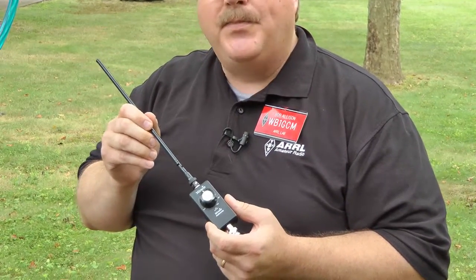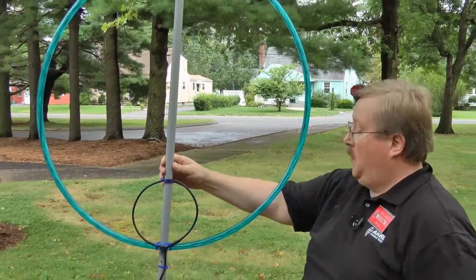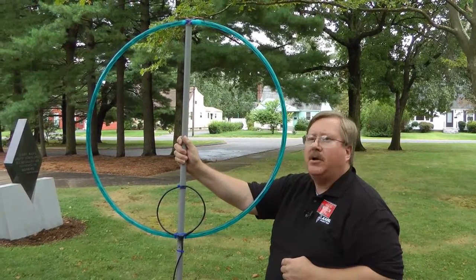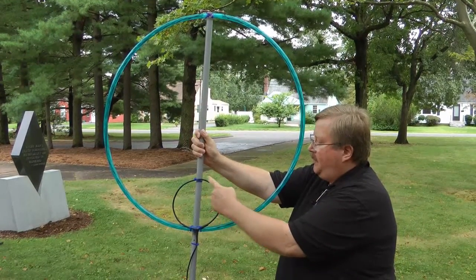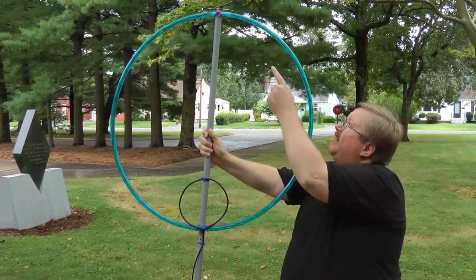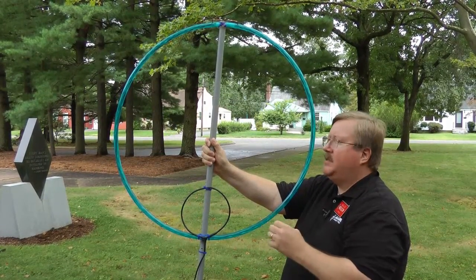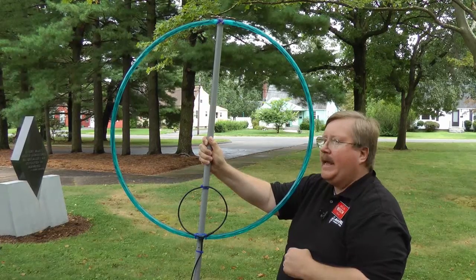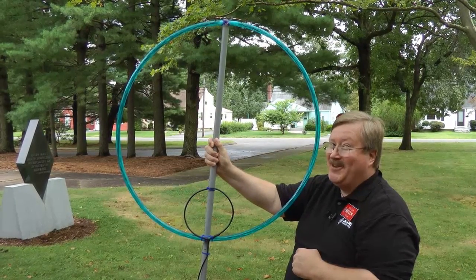So I decided to build an antenna. And here it is, introducing the Hula Loop. It's a Hula Loop with wire inside - it's a magnetic loop, you've probably seen these in past articles of QST. This is a simplified design that only consists of three parts: the induction loop, which is 2 feet in circumference; the tuned loop, which is 10 feet in circumference; and the fixed capacitor at the top, which is about 152 pF, allowing resonance at 7.290 MHz. You can walk and talk with it, and I hear shortwave, amateur signals, AM and sideband. And it all costs under $10.